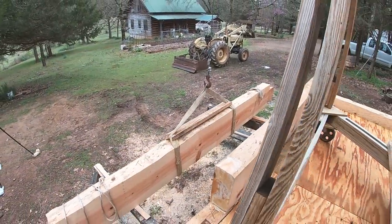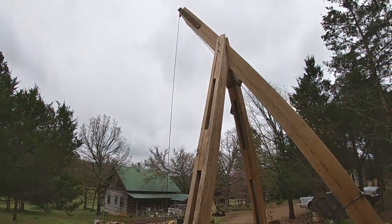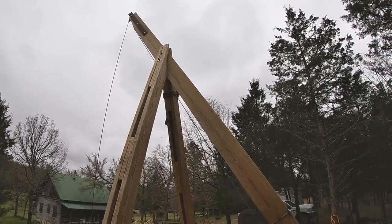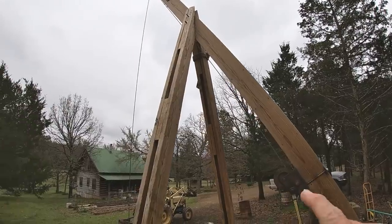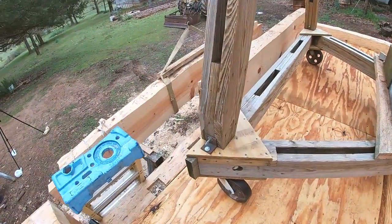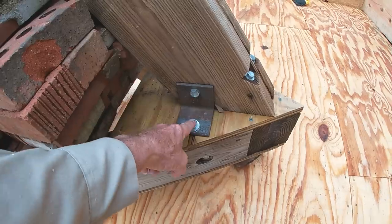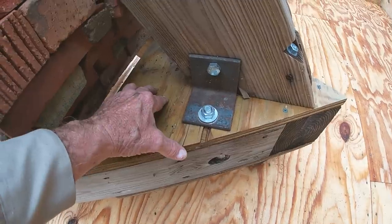I'm ready to lift round two D wall log up here on the building. I've got it strapped up to the hoist — this is something that I built and it's worked really well. The boom itself is two treated two-by-eights with half-inch treated plywood sandwiched in between, glued and screwed together. The legs, as you can see on both sides, are two-by-sixes, anchored down at the bottom with a bolt and a piece of angle iron on the corners. The back of the boom is anchored with a half-inch bolt that goes through here, and these bolts go all the way through the back end of the base. All of this underneath the plywood is solid blocking.